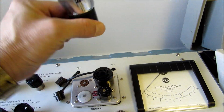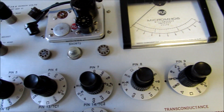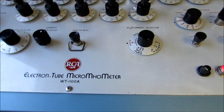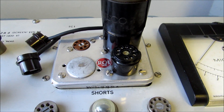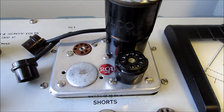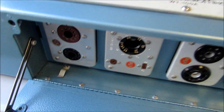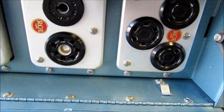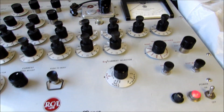So we're going to pull this tube out of the socket. If you want to match tubes with a high degree of accuracy, we've got another 6F6G that we're going to put in here, and this is hopefully going to make a matched pair. While the tube is warming up, there's another nifty feature: the actual tube modules are plugged into an island which contains several sockets — this one has octal, 9-pin, and 7-pin. For all other tube types, there's a storage compartment on the front panel with Magnaval, Compactron, Acorn, Subminiature, Loctal, and all antique type sockets. When those are needed, you merely pull them out and replace the socket that's in there.